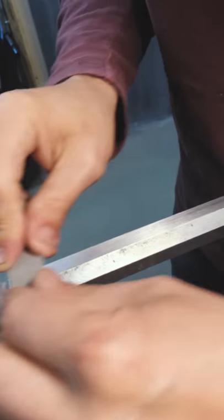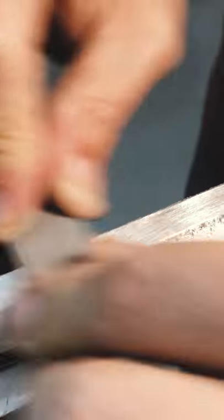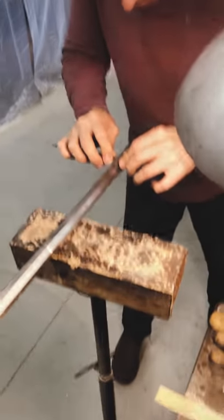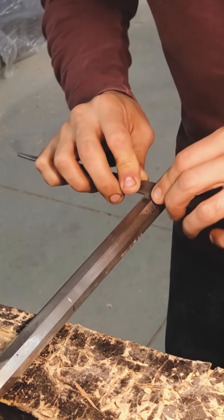This is going really nice and smooth. I'll go the other direction to work up to the sight — that looks pretty good. Just go far enough to remove the mill marks and don't go beyond that. Starting from the other end now; the part is moving around a little bit since it's hanging out of the vise a bit far, but we should still be okay. Slowing up along the side so it doesn't wreck anything.